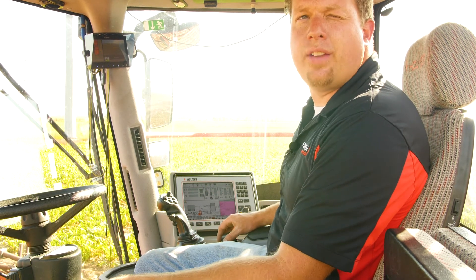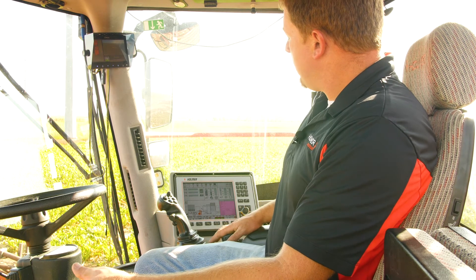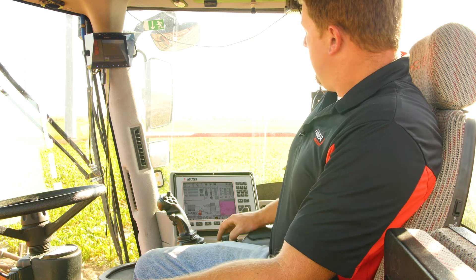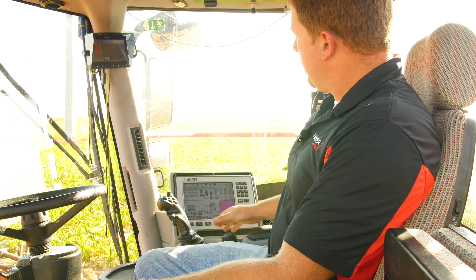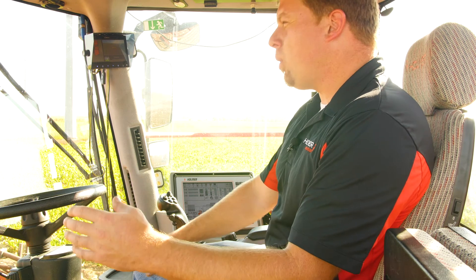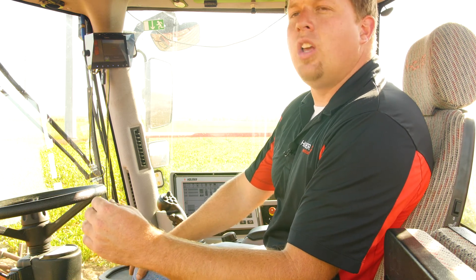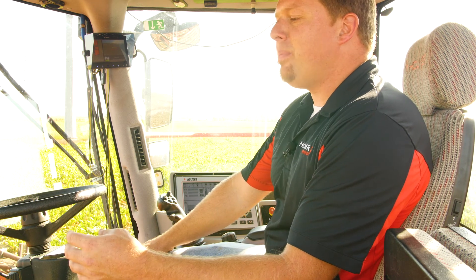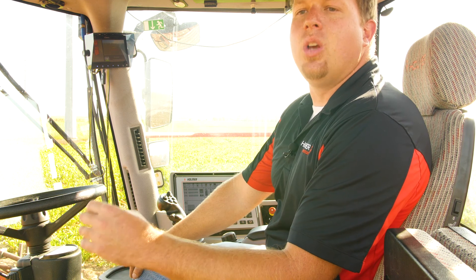Next is roll bed speed. The green dots indicate which section you're adjusting. The first ones are the actual spiral rolls — you can change their speed up or down. Faster is better for late season when you're trying to get more action in the rolls to get the beets tumbling and get more dirt off. Slower early on, since you're just trying to move the beets. You can also select the back roll independently — change its speed and direction. When the white arrow faces forward, it's going against the grain; when absent, it's going with the flow of beets. For transfer web speed, set it so you're moving beets from the header without letting them bunch up, getting them to the turbines. For the turbines, you can run all three speeds together or select them individually to increase tumbling and get rid of more dirt. Grate height: number one grate is independent of two and three — run it as high as you can without losing any small beets. Grates two and three are adjusted together and follow the same principle.